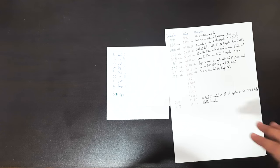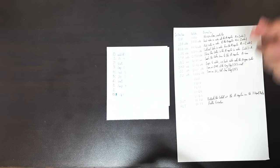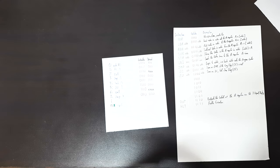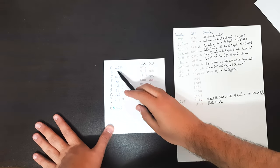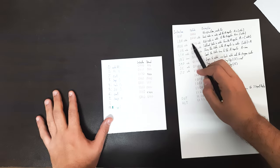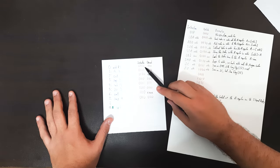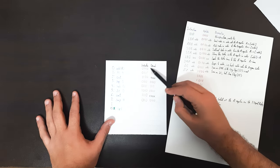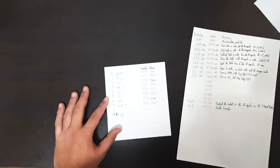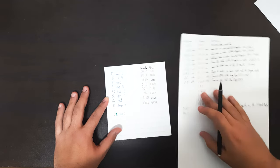Let's go ahead and assemble and program it. We're not compiling C code, just assembling. Each instruction has an opcode. So for example, add is 0010, and we pair it with the operand hex F (15 in binary, all ones). Jump-carry is 0111 and then the operand. The OUT command doesn't require any operand so we can leave those bits as don't-care.